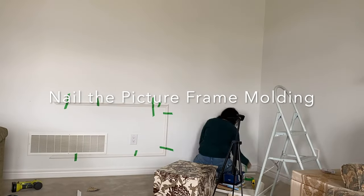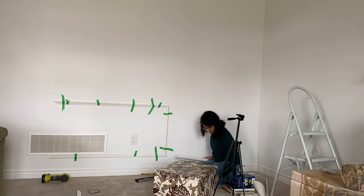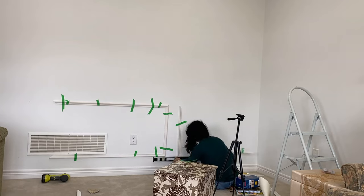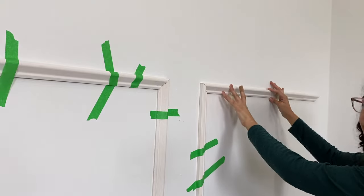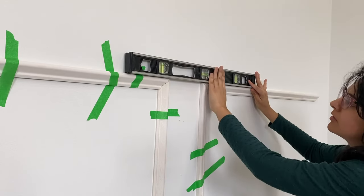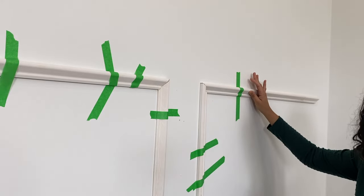The next step is to head over to my mom's house and actually install these. I tape my trim to the wall first — I find it reduces errors. I use painters tape to tape all the pieces and use my level to double check that they're all straight. If you're feeling really confident you could totally skip this step, but I think it's a really good thing to do especially if you're a beginner. After you've built your first box, you need to make sure the second box is perfectly level with the first box, so I take my level and put it at the top of the panel molding. Once I'm confident it's perfectly level, then I can tape the piece to the wall.